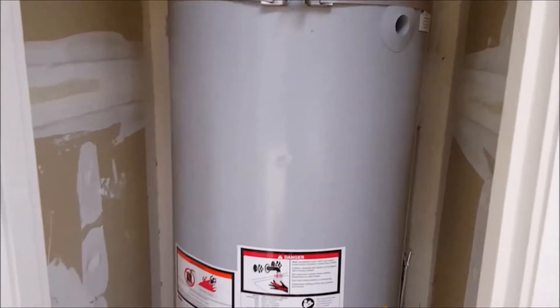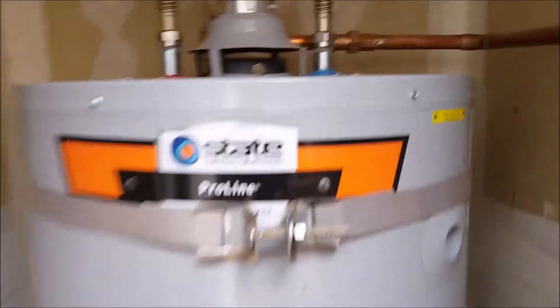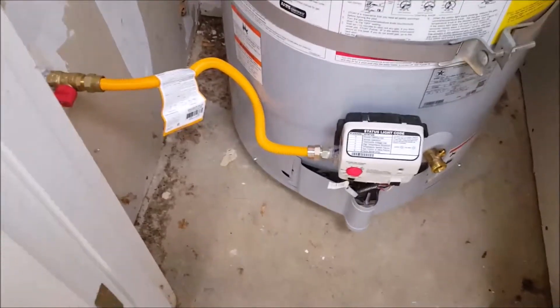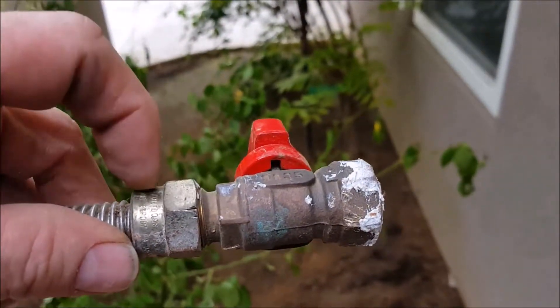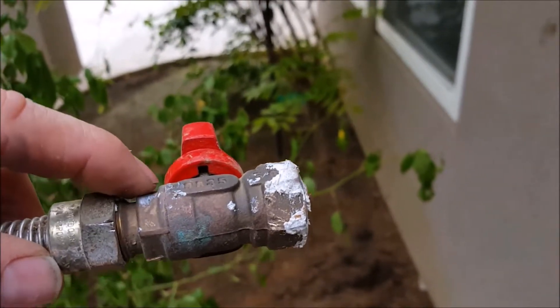Still at Clovis, California — downstairs water heater now. We wanted to get this supply line replaced. Everything else in here looks good and tight. The concern down here was just the supply line — another plumbing contractor installed the water heater but didn't replace the supply line, so we replaced that. However, taking it apart we noticed that on the existing gas valve there's a nut that actually unscrews from the valve body — and this was loose, actually leaking propane right through. So instead of just tightening it down and hoping for the best, we replaced the entire valve.